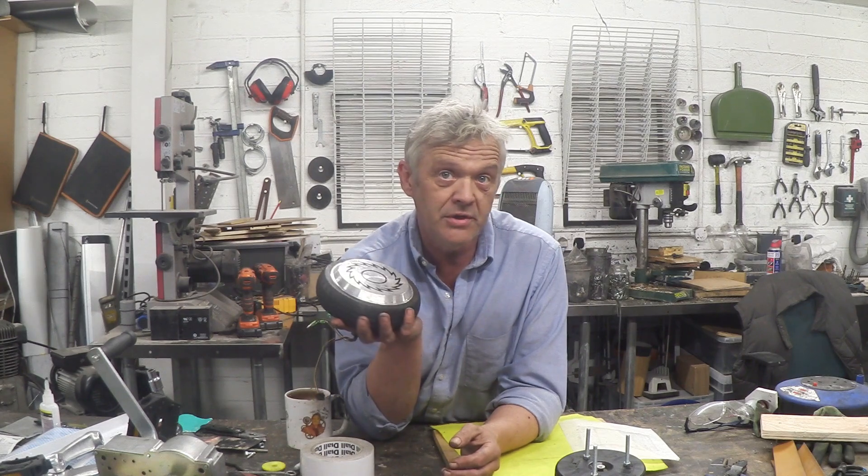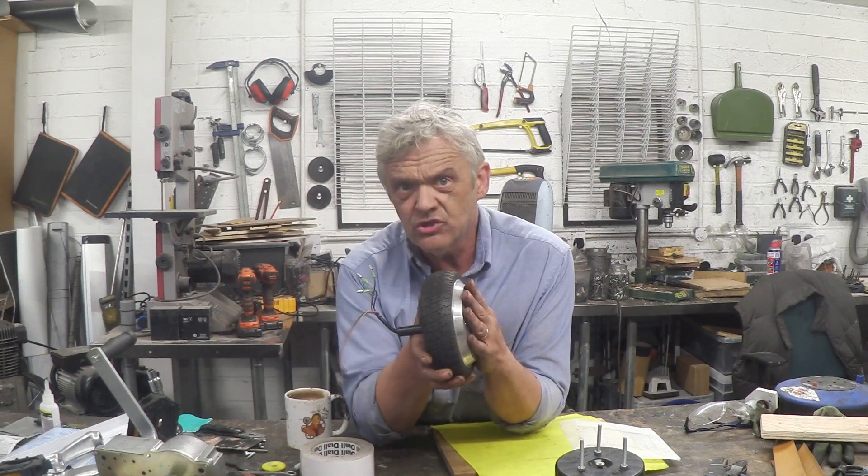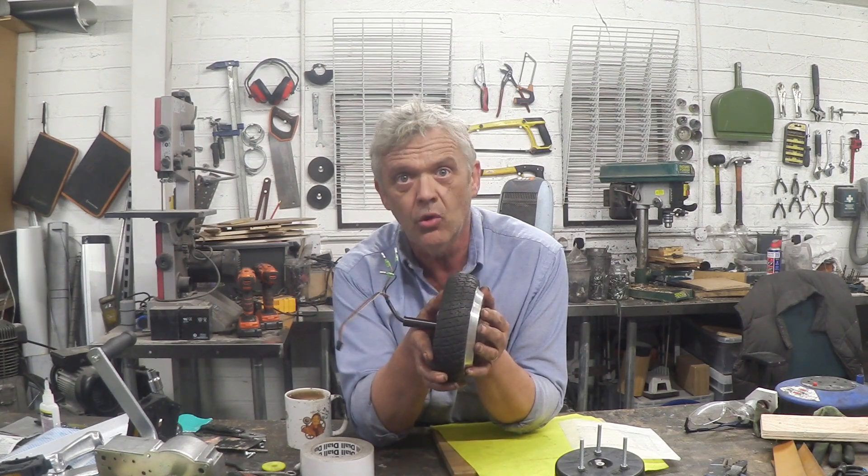That setup with the bamboo blades and the resistive load for taking readings was exactly the same setup we used when we did this — a car motor from a radiator fan, just an old DC motor. This one gave better results but not impressively better — okay but not gobsmacking. They were better for one simple reason: this one has very powerful neodymium magnets and this one has ceramic magnets. Remember any generator is defined by the number of turns of wire, the strength of the magnetic field those wires are cutting, and much more importantly the speed at which they cut, because power is proportional to the voltage squared. It shows that the development of the motor isn't nearly as important as people seem to think — what's important is getting speed of rotation more than anything else.